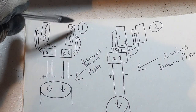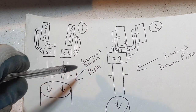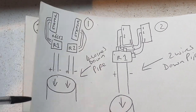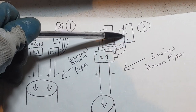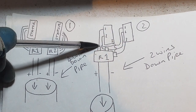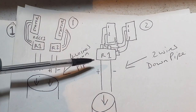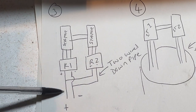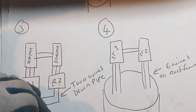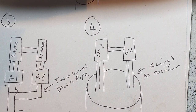I've been thinking about different ways to run this. At the top of the turbine, the two stators each have three phases coming out to their own rectifier, going down the pipe as two separate DC cables. Another option is that phase one from each stator joins onto one connector on the rectifier, phase two and phase three the same - so theoretically you'd have one DC output down the pipe. A third way is two separate rectifiers with the DC outputs joined together, giving one set of wires down the pipe. You could also bring all the AC wires down the pipe and have the rectifiers away from the turbine.